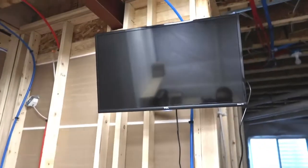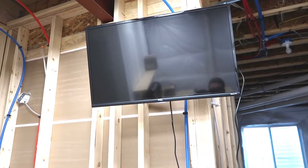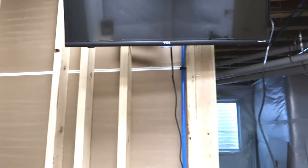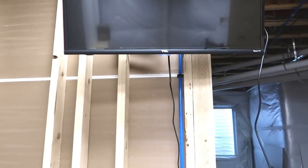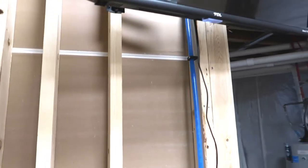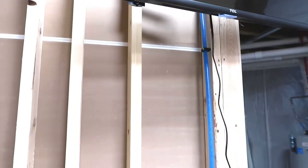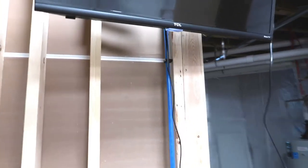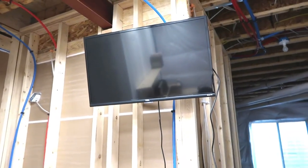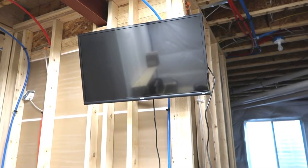The first thing I'm going to do is unmount this TV — I think I mounted it a little too high. I'm going to put a square piece of drywall behind it; I don't have to, but I think it'll look nicer. In the drywall, we'll install an old work box to put the ethernet jack in and lower this TV a little bit. So first we'll pull the TV down, cut a piece of drywall, put that up, and then run our ethernet line.